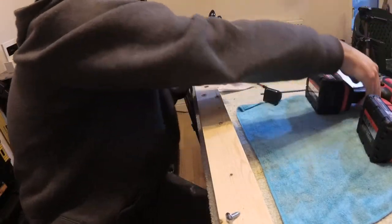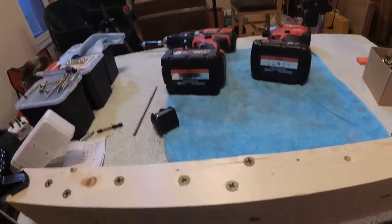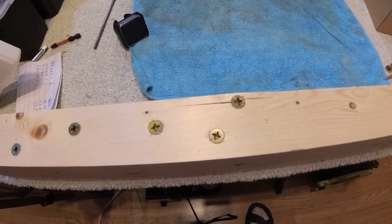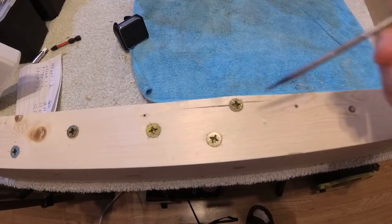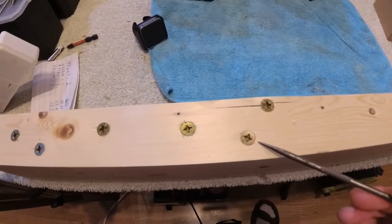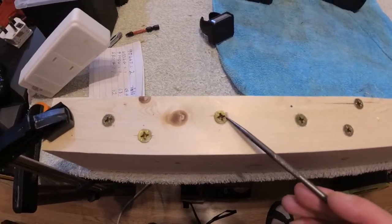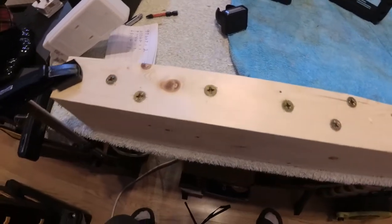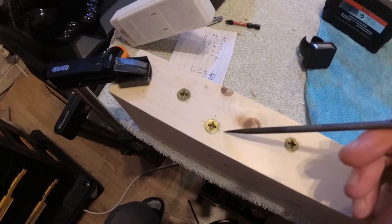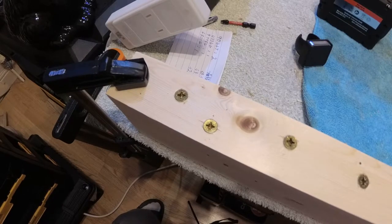That's enough — I split it again. Over we come and have a quick look at these screws. Right close to the edge — split. And this is decent wood, not that cheap. That was done by the hydraulic drive, got a bit of clicking again with the hydraulic drive. If anything I would say the combi is actually doing a slightly better job, but there's still slight splitting. I'll take these screws out and get some decking to try.